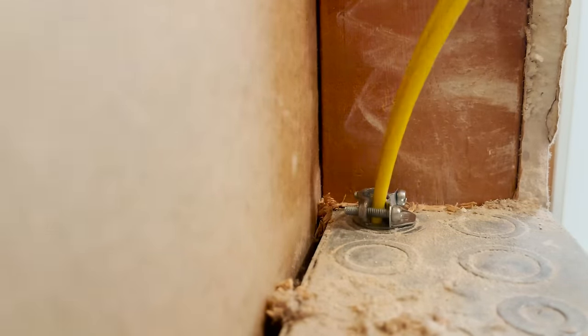Now there were some crazy things in this panel. I noticed none of the grounds are actually touching each other - they're using the panel itself as a way to connect each ground. And they put like three or four number 12s into one lug, which it's not listed for that - so that's not okay. And then they put these two-inch pop-in bushings as their means of all the conductors coming into the panel. There's nothing strapping or holding the conductors, at least on the top. The few conductors that came in had some staples - so within 12 inches of the enclosure to code they are stapled - but the rest of it was not okay. There's just all kinds of crazy conductor underneath this panel. This is way out in the middle of sticks out in Texas, and there's a lot of places out there that look very much like this. This actually wasn't too bad compared to a lot of stuff I've seen, but I wasn't there to fix old Randy the handyman's work - I was just there to do my own job correctly.